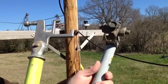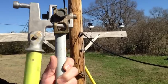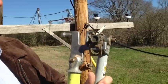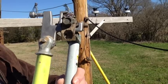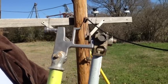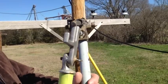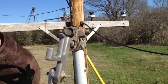This is the fuse barrel hanger and how it works. It comes in right here, holds over the top, and gives you points to help hold it onto the tool. When you're hanging this fuse barrel, sometimes fuse barrels need to be kicked out for setting them — you can do that with this tool. You can put your phase in here and pick it up. If you need to come in on the front with the bigger finger and kick it in, this isn't the preferred method but it will work for taking your fuse barrel down also.